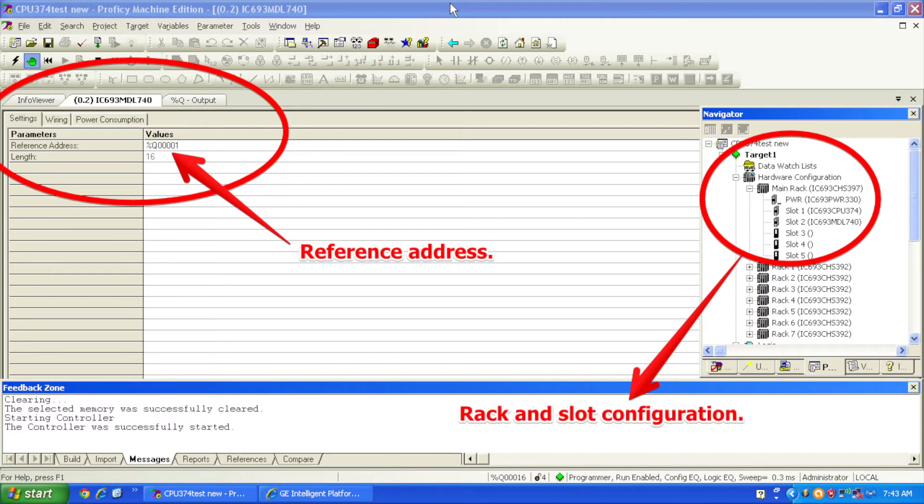What I'm going to do is click the toggle online button, which is the icon that looks like a lightning bolt. I'm going to go online with it. You can see we're blinking here. Once I'm connected, I'm going to hit the green handprint, which puts us in programmer mode.